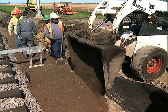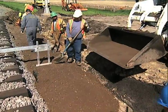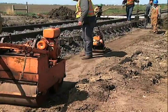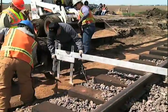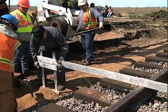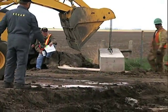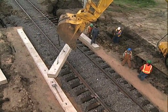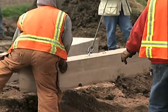To install the Bodan system, begin by preparing ballast and sub-base. Spread a fine compactable aggregate mix and compact it using a handheld whacker. Use the Bodan leveling tool to set depth to the rail. Lift and place the precast concrete beams onto the prepared sub-base. Set and tamp down to assure design grade and spacing from the rail.